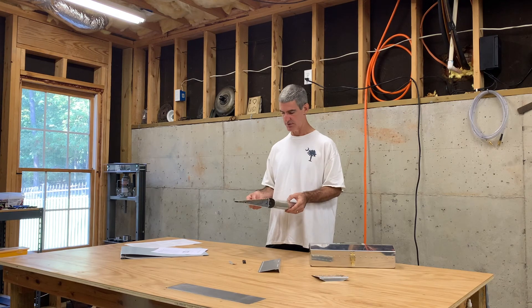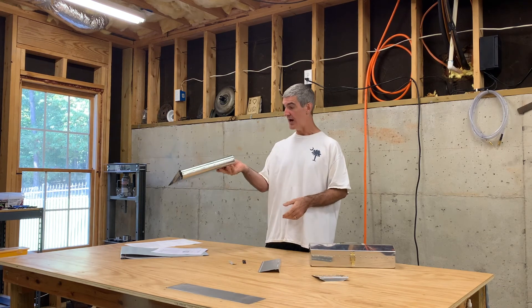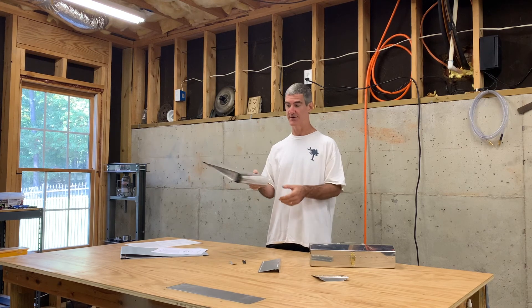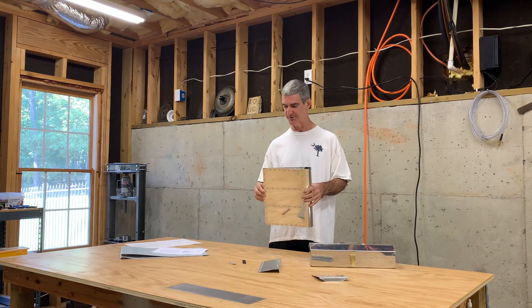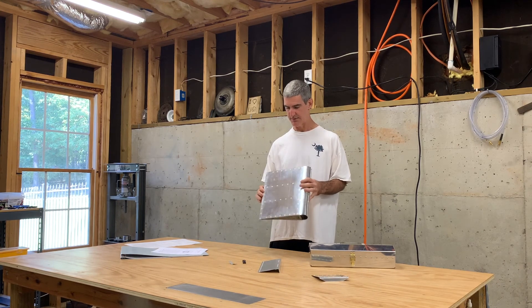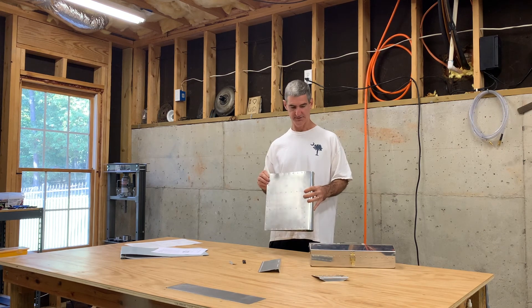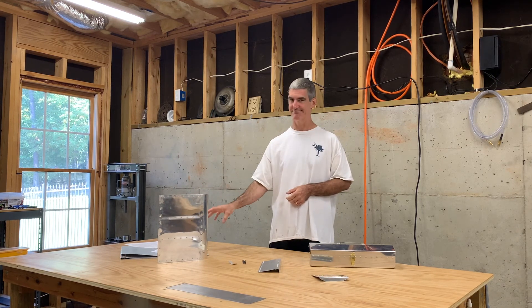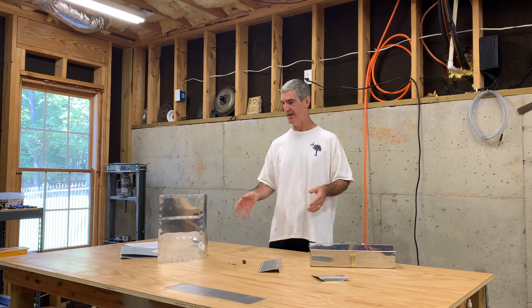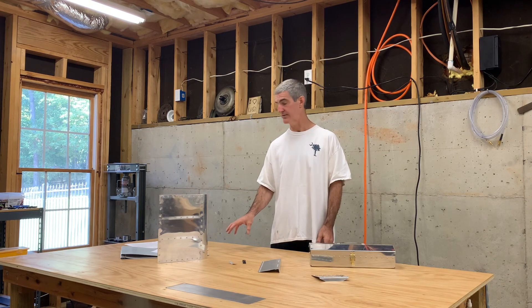Other things I've learned? The structure is amazingly strong once assembled — this would fly; I think this would be a totally safe part on an airplane. Cosmetically it's not great but not terrible; I've seen worse on real airplanes after years of wear and tear. To me the most important thing was the confidence that came with reading the military spec document about rivet tolerances, and then messing up a rivet, drilling it out, being able to get it out of there and come back and fix it.